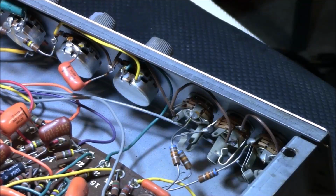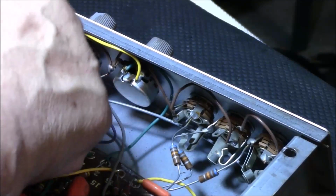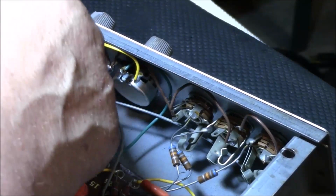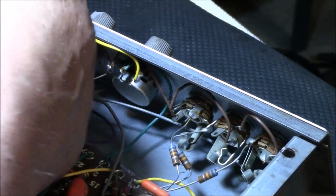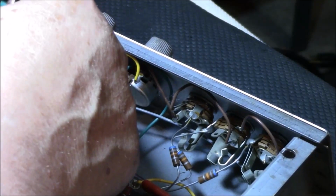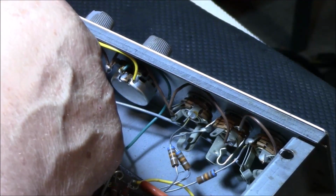No, that's not good. That's a 35% loss on that resistor. Okay, that's going to have to come out. Number 1. Of course, I'll take it out of the circuit and test it too, just to be sure. Well, I hang a new part on there, but these are dirt cheap. So it's not a really big price involved when you do these.